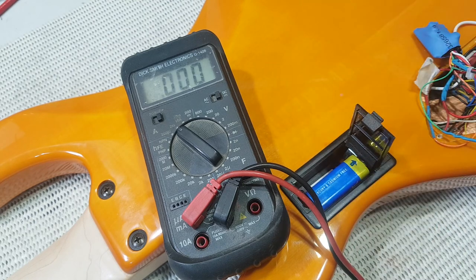Make sure you've got a jack in the plug if you've already wired it into the guitar. That way the battery negative will be earthed and it will allow the circuit to switch on through your meter. I'd first test it without the op amp, especially if you're new to this. You'll get something like 100 microamps around there for the sort of raw circuit.